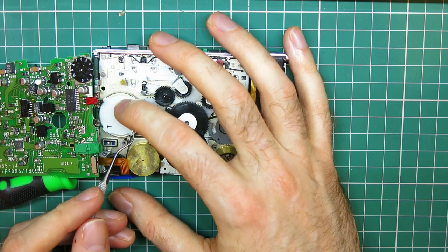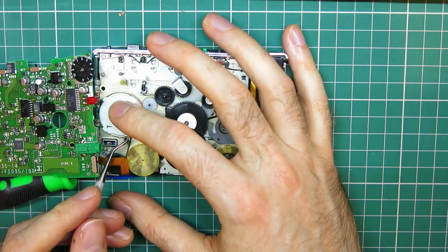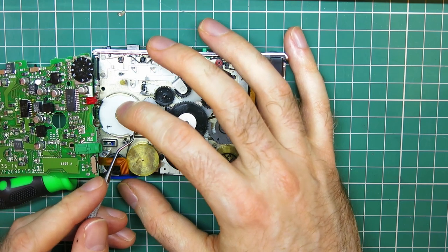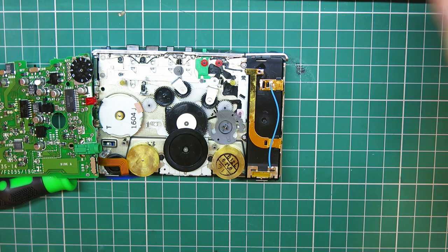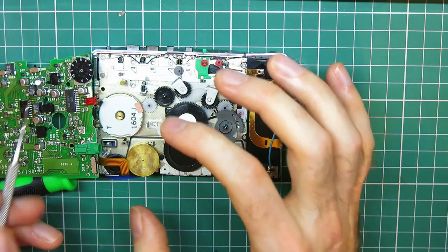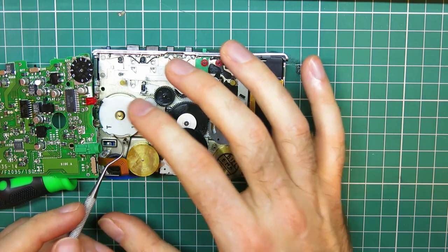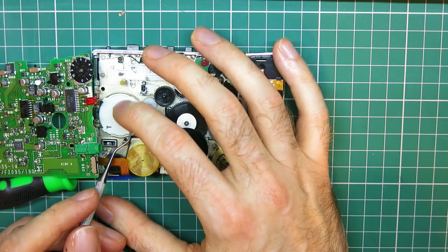And I don't know if they have any kind of feedback winding, I'm not sure, but they basically give it a constant voltage by firing pulses into each of those coils in succession. That way it can regulate the voltage to the motor and thus the RPM as the battery voltage droops. One dead giveaway of a bad motor, if you've recapped the board, is that as soon as you start to drop the voltage to, let's say, less than 1.5, the motor immediately starts to struggle. That's what my other one was doing, and then it started to seize. So that will freely move.